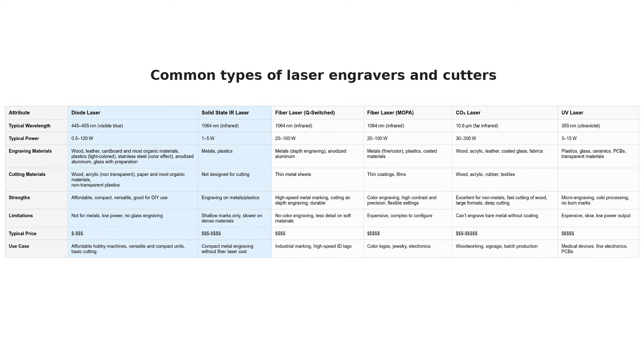There are other kinds of wavelengths and laser engraver types that can do some things better, especially for completely clear materials. CO2 lasers for completely clear acrylic or UV lasers for glass have their niche, but these are also very expensive. With the A1 Pro, you have an affordable option to do most things, as long as you don't need to cut metal or thick, completely clear material — though you can engrave glass if you prepare it a bit. I've included an overview here of common laser engraver types and laser sources. The two types on the left are the ones used in the Falcon A1 Pro; the others are more expensive professional options.